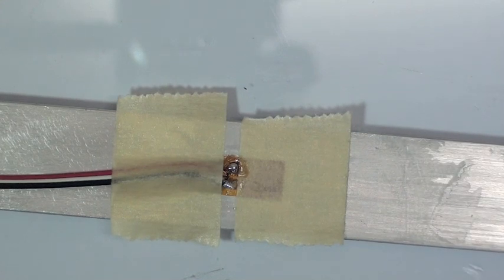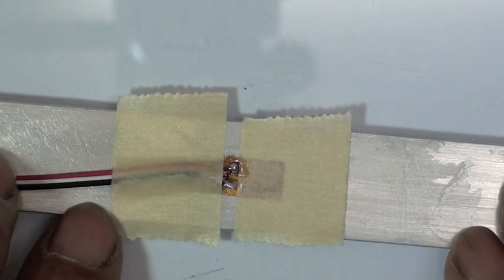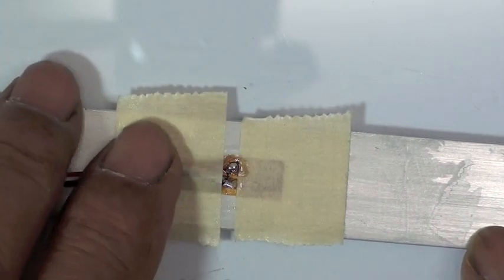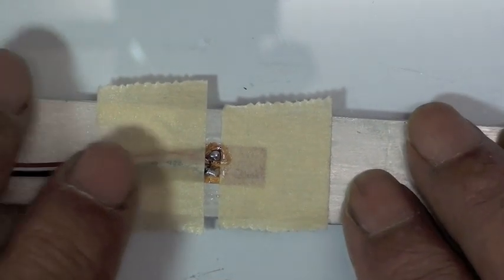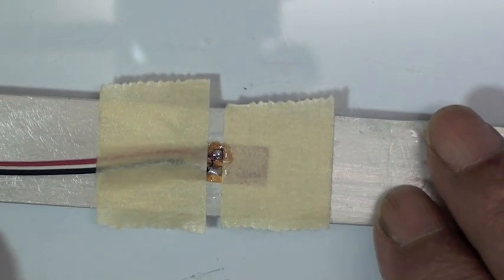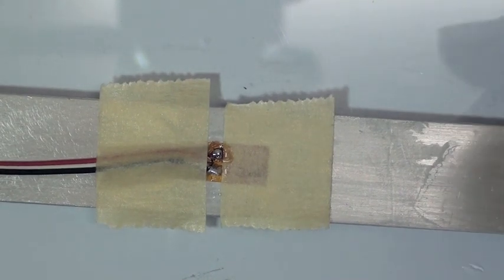And it's done. And folks, you'll notice that VJ did this without using any external flux. We just used the rosin core solder to achieve very good solder connections on the strain gauge, which is a good thing later. Flux is useful when you're actually soldering, but it becomes a contaminant that can cause problems with your strain measurement later if it's not thoroughly removed. And that's in fact our next step.